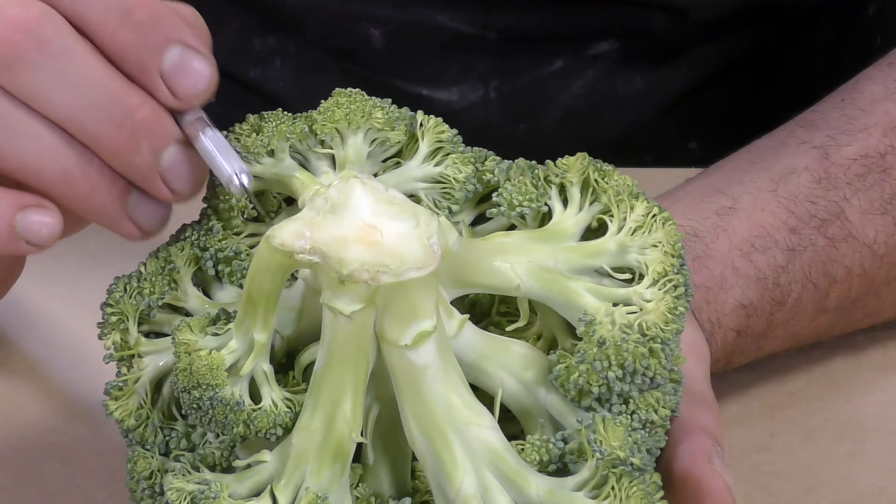When I first started this project I thought I could get away with just making a block mold, similar to the one I made for the large pine cone. Unfortunately this was a huge fail — even though I got the original broccoli out and cast material into the mold, the casting tore up the mold quite a bit. It bonded mechanically to the mold and was very difficult to extract. I tried different techniques, molding materials, and sealers, all of which resulted in failures.